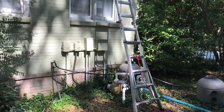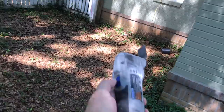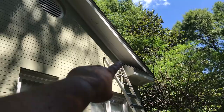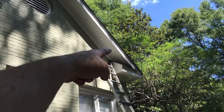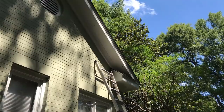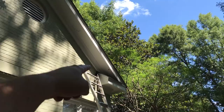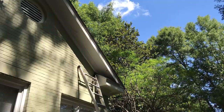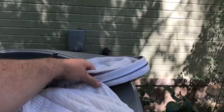They've got no power outside the house, running cords through the windows. So what we've got to do is section that crown trim and then that soffit — there's a seam in that soffit right about there. The fascia board is probably dadoed or grooved on the back where the soffit fits in. I have to knock that fascia board loose, section the crown, and get under the seam in that soffit board and pull it down. It looks like there's probably a division board — a soffit support in there — that's stopping them from going any higher than right above that hole.